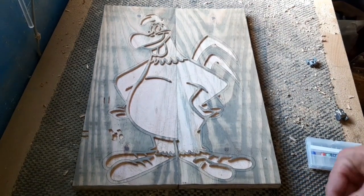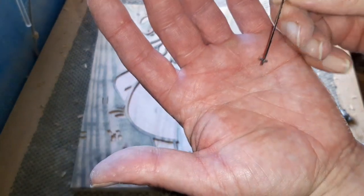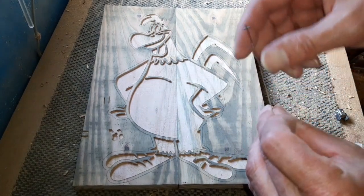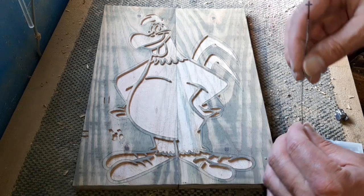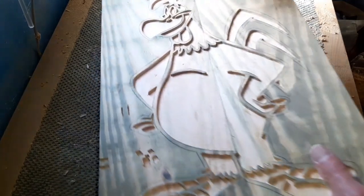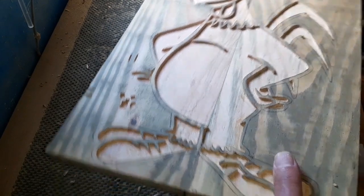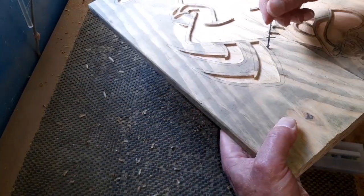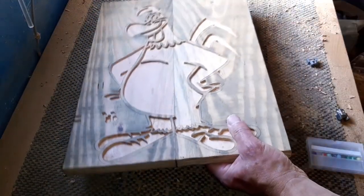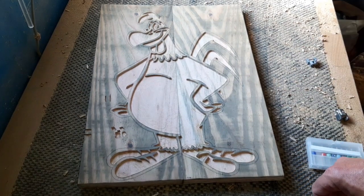The other two options with your blades is a more common blade, a pinned one. You'll get a pin at both edges, and they just hook onto your cheaper saws, I'm going to say. And you want it smooth on the way down, rougher on the way up, and the blade facing towards you. You could use this one on this project, no problem, because there's nothing too technical. With this one, though, you will have to feed that in. Imagine coming down there, feed that in, and then turn the piece completely to feed down there. And then you'd have to turn it again to do that, and then turn it again. There's a lot of turning and twisting. That's one of the reasons I don't like to use them. But there's some fantastic folk out there that make it look so easy.